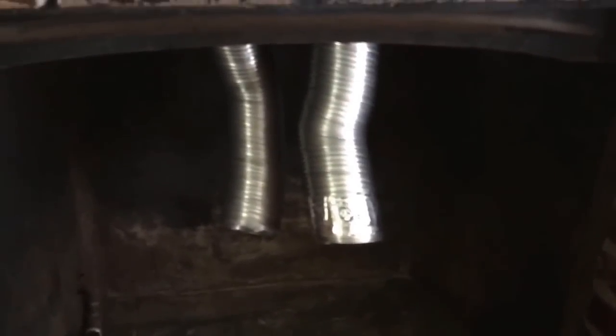So we're back here and we've got the vent pipe coming down — two three-inch pipes, one is the exhaust and one is the fresh air for combustion. Make sure you label them so you know which is which, because you've got to hook them up correctly to the insert itself and to the cap. We've got our gas line hooked up with the valve and the vent pipe, so we're ready to bring in the unit.